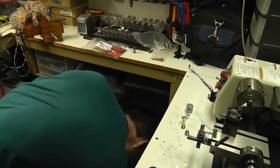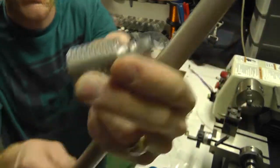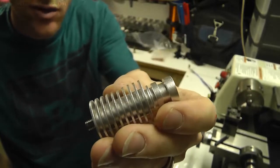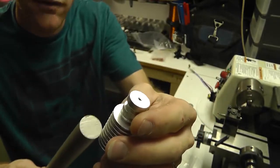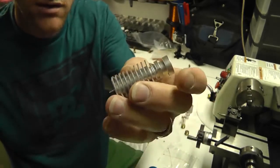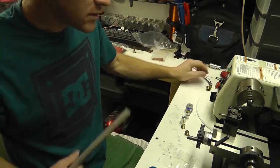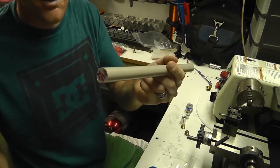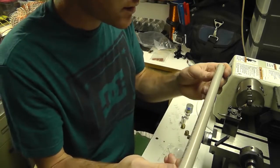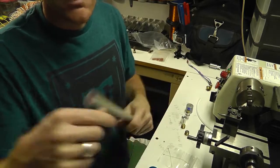These are actually, for instance, here is one of those pieces without the Hotend on it. And I really don't like this all-metal Hotend because you absolutely have to blow a fan across here, and I just don't want to. So, I'm not going to. I'm going to be switching back to this old style. So, here we go. Starting with PEEK, P-E-E-K. It's a high-temperature plastic, and this is 0.75 inch OD. Let's get to building.